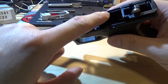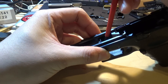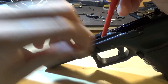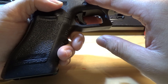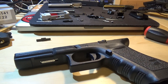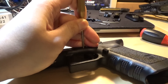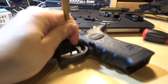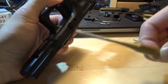Next, you need to work on your frame. Take out your trigger bar — it's not too difficult so long as you follow this very carefully and don't be too rough. First, take out your takedown lever: push this silver leaf spring down, and while holding it down, move the takedown lever off your frame. Next, punch out your trigger pin — do not remove the other screw yet because you don't have to. Since it's on a brand new frame, the rough side of the pin will be on this side, so you can punch it out. That's the rough side of the pin right there — it comes off fairly easily. The hardest part is just punching out your pin for the first time.